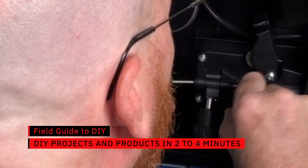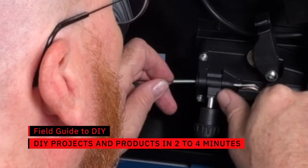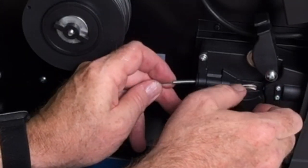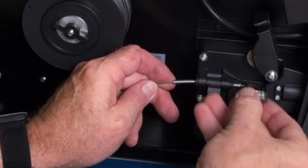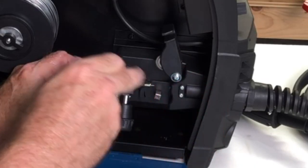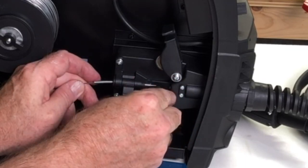Fit the wire spool so that it feeds from the bottom of the reel towards the drive unit. The wire must sit in the appropriate groove for the wire gauge — the groove size is etched on the side of the roller. Do not let the filler wire become uncoiled or tangled as this will lead to problems with delivery. The roller is marked with a size; in this case it's size one, so I'm going to have it facing out.